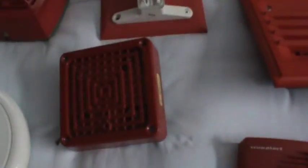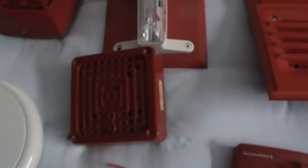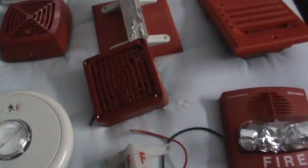Now, Federal Signal — there's not too much to worry about. What Federal did before they started buying from Potter was take a strobe such as an eye strobe and put it on top of a horn. So pretty much all Federal Signal alarms are four-wire. You can take the strobe and put it on top of a horn, or put it on top of a plate and have it as a remote strobe. When you're looking for an older Federal Signal, there's not too much to worry about.